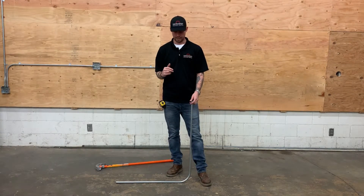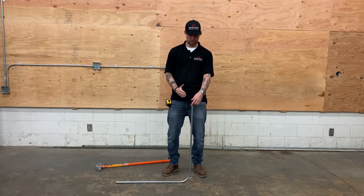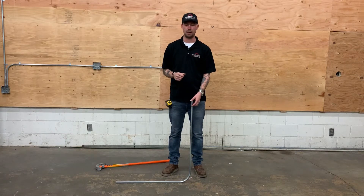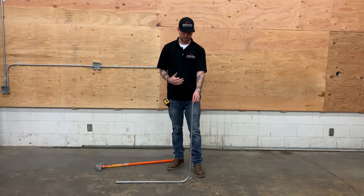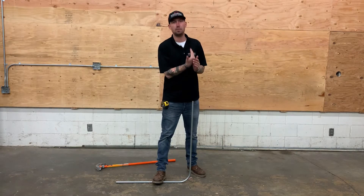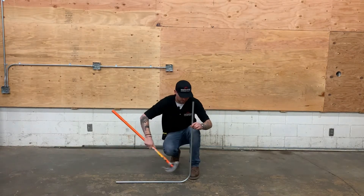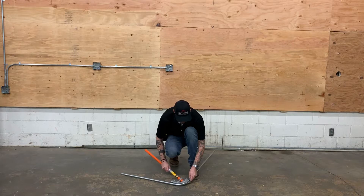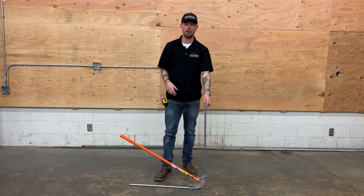Now we're going to go over corrections of your 90s. Sometimes you might go a little too far, or maybe you think you're good but you're not quite at a 90. In the first instance, let's say I'm not quite there — I'm not quite at a 90. For the most part, I don't like to do too much correction on not-quite-a-90, just because I'm not keeping the proper bend radius. So if it's not quite a 90, I'm just going to put the bend back in the bender, re-line it up on the line, hit my arrow on there, and make the adjustment. Once I make the adjustment, I'll re-look at it and make sure I'm good to go.